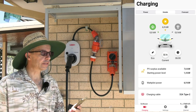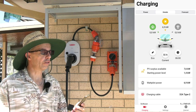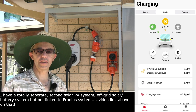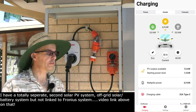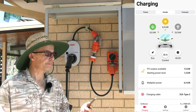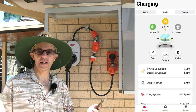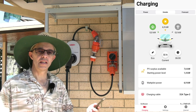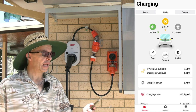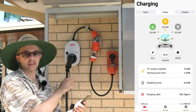On the details tab, we've got zero kilowatts from the house battery (we don't have one), 6.9 kilowatts from solar, and zero from the grid. It shows our eco mode, current, and timer. Below that, the surplus PV available is 7.6 kilowatts — meaning we're generating 7.6, putting 7 into the car, and using 0.6 kilowatts in the house. The Wattpilot's power output is 6.9 kilowatts, and it has detected a 32-amp Type 2 charging cable.